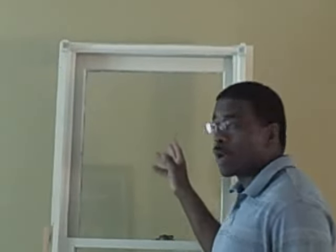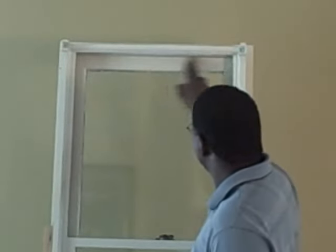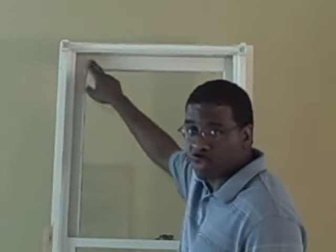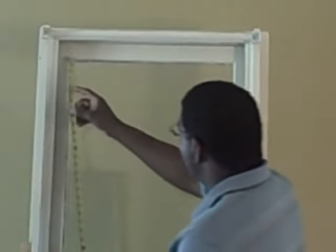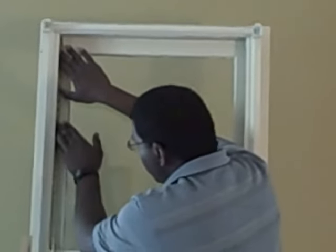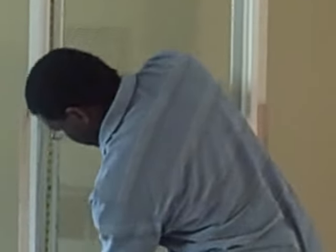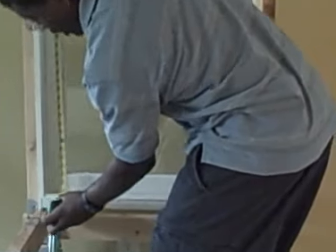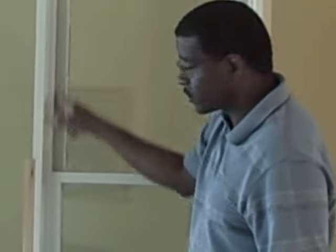The first thing you need to do is measure your window correctly. It's important to know that the window cover attaches to the frame of the window, not the glass. So when you take your measurements, make sure it's along the frame. Take the tape measure across the top, frame to frame — 22 and a half inches. To get the length, start at the top and smooth the tape measure down, making sure you come across the offset of the slider, which is about an inch and a half. For this window, that's 54 and a half inches.